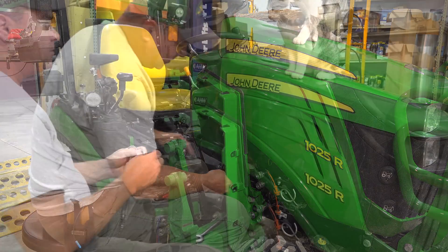This is another area where a Deere supplied kit just kind of goes above and beyond. These hoses have internal hoses, then a nice covering, and then a third level of covering to try to protect them from whatever they might encounter. There's really nothing to this — we're just going to put these new hoses back on the very same way, match up the colors, red to red. The top one is yellow, then black, then blue, then red. These are the O-ring face seal type connectors — they don't have to be crazy tight, and it's a good thing because you could twist the hard line if you got too serious with it.